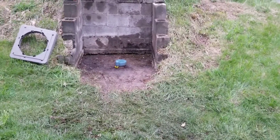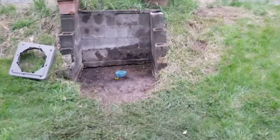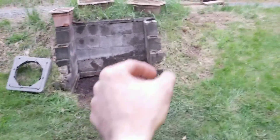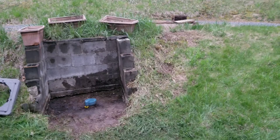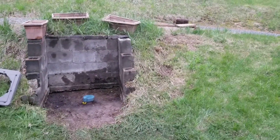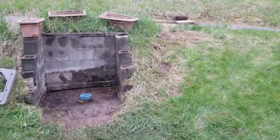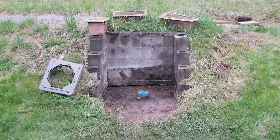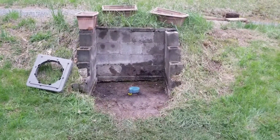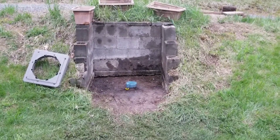I put a lot of weight on the end of the hose to keep it from pushing back up out, and it still pushed up out — I probably had like five pounds, should have had like ten. Also, the tube I put on the end of the hose came out at a 90-degree angle so it wouldn't create a rocket effect and shoot back up out. I also removed my regulator off the air tank and went right out of a three-quarter inch line, and the reason I did that wasn't for pressure — it was for volume.